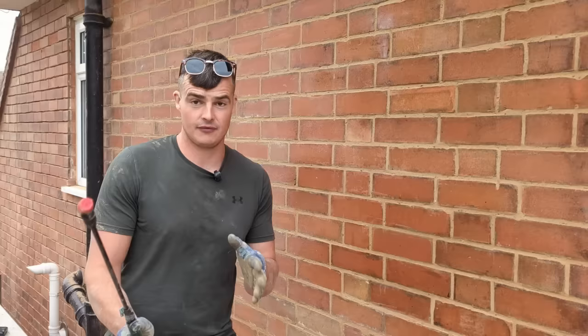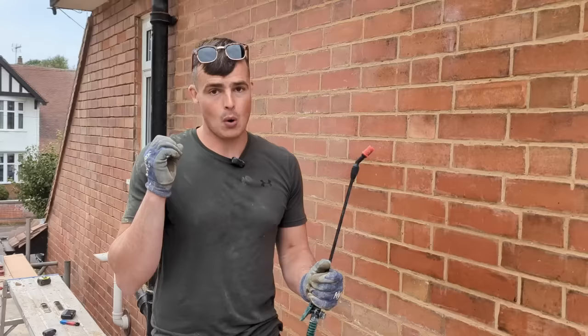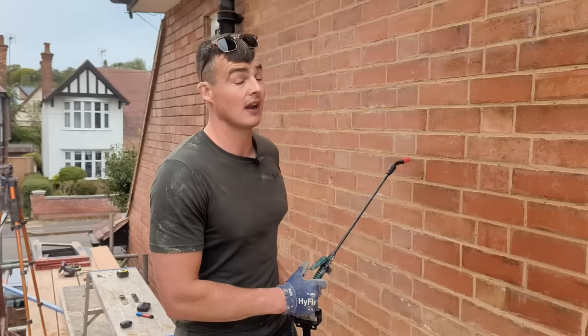A few days ago, I mentioned how one of the clients is getting quite ill because of all the damp that's been gathering behind this one wall. What happens when we put sand and cement on an old lime mortar house? Water goes into the brickwork, but because it's got such a hard material, such as sand and cement, on it, it can't come back out and evaporate. So it's caused black mold on the entire backside of this wall, and it's really causing havoc with the client.